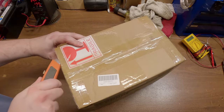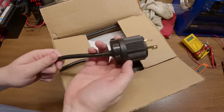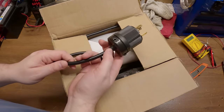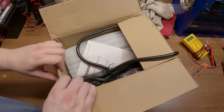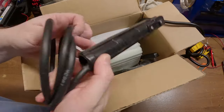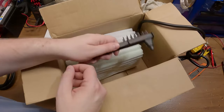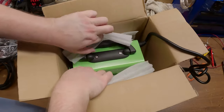So let's get this thing open. It comes already pre-wired with a twist lock plug. Now I don't have twist lock on my only 220 outlet, so I'm gonna have to rewire this — but I also want to rewire it for 110 to see if it'll actually work. Here's our user's manual, here we have the electrode holder, the ground clamp, and one of these little brush-hammer thingies for knocking your slag off. And here we have the tiny little welder itself.